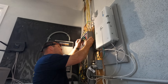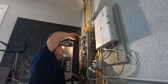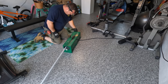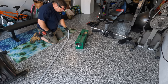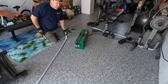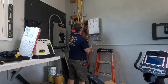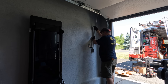He has a 200-amp panel. When they put it in — I think in 2012, right after Sandy — they gave him a 200-amp service but only a 30-circuit panel, which to me is not getting the real value of a 200-amp panel. You want at least 40 spaces at a minimum; you can have 40, 60, or even 80 circuits with a 200-amp panel. That never made sense to me. He did have one space — a 50-amp double-pole circuit he was no longer using — so I was able to use that existing circuit breaker to connect the new electric vehicle charger.